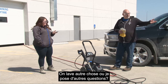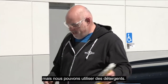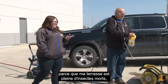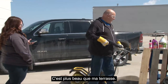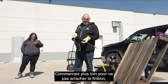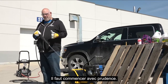We've got a pallet here to simulate some old decking or old fence — let's see if we can clean it up. We don't have any deck-specific cleaner but the detergents we have work as well. We haven't sprayed this previously so we'll just go over it and give it a go. With any pressure washer, you want to test first by standing a little bit further back — you don't want to start pulling off finish. On a car you don't want to strip paint or decals. Always start with caution and go in closer rather than too close to start.